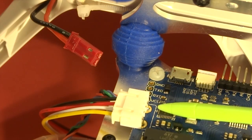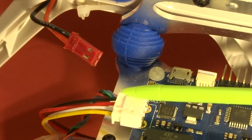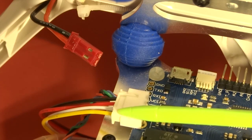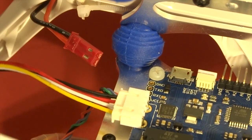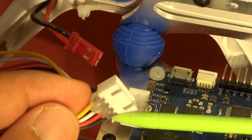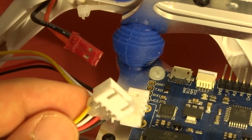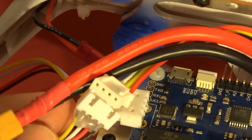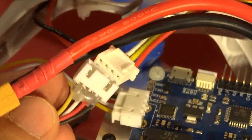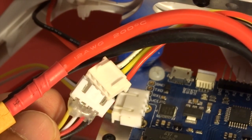Next important tip: the pre-wires have been wrongly color coded for this gimbal. You can see that positive is black and yellow is negative. But it is reversed correctly on the balancing part. If you take a look at the battery, they match red to black and black to yellow. So they work just fine with no issue.